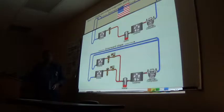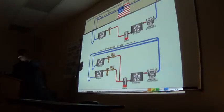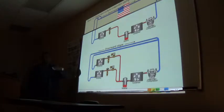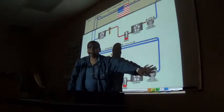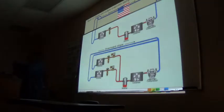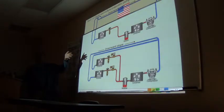The only time you see me do 4 inches per foot is probably on a freezer drain line, to drain water as fast as possible outside of that freezer so it doesn't freeze up when the unit kicks back on. Other than that, quarter inch per foot, which is pretty much standard plumbing rules. Follow that and you get it. The slope is just to assist, it's not to take over the function of this, because ultimately it's the compressor suction pressure that pulls that oil back, not the slope. Of course, the slope lets it drain in the off cycle.